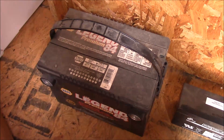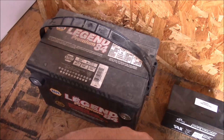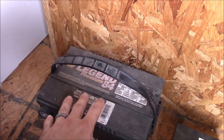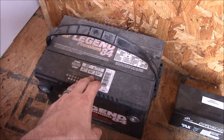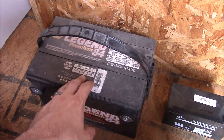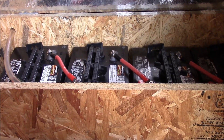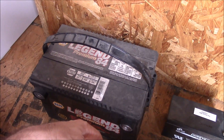Car batteries are otherwise referred to as flooded lead acid batteries. They are user serviceable, so you can replace the water that evaporates out of them. But the difference between these and flooded lead acid batteries designed for renewable energy is significant. The way I like to describe it: car batteries are like sprinters. They're meant to provide a lot of juice fast, they don't last very long, and they're not meant to go very long between charges. Whereas renewable energy batteries are meant to be drained slowly over time and drained much further down. You can drain deep cycle batteries down to 50 percent no problem, over and over again. Car batteries, if you drain more than about 10 percent — if they go below about 11 volts — they're basically dead.